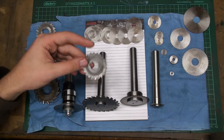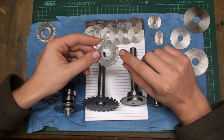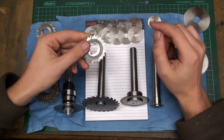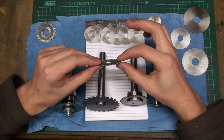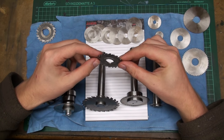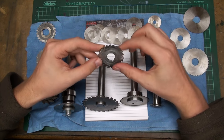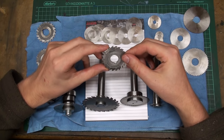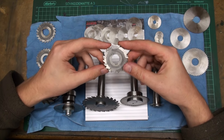On the other hand you can get staggered tooth cutters like this, and these are real milling cutters. They don't only cut on their diameter, they also cut on the face. So they cut a very precise slot with very clean walls, and you can actually machine sideways with them. Of course with a pretty low depth of cut, but you can cut a shallow groove with radii with these. I have done this and it works very well, but you have to be careful as these are really expensive.